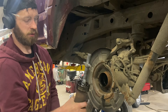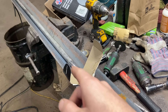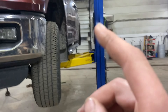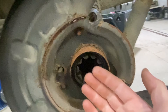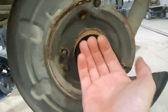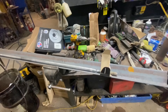I'm building my own slide hammer from scratch. I had the creative urge to build this because I'm working on a Ford F-150 — I'm changing bearings. The issue is these bearings get pressed into the tube, so to get them out you need a special tool: a slide hammer that reaches in and grabs behind the bearing so you can pound them out of the tube and drive new ones in.